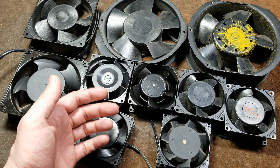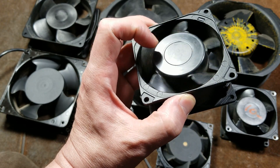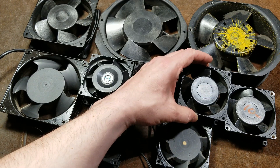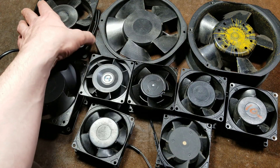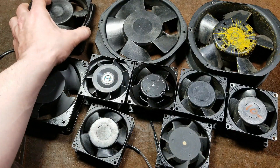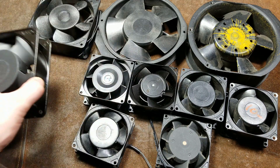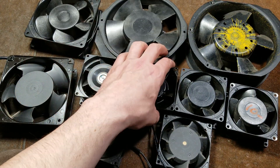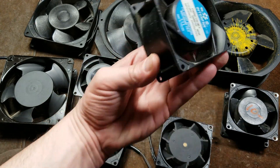It's one of the reasons you don't actually see bigger fans in brushless DC — the electronics are too expensive and the advantages of power density aren't required because now you have a big fan, you can put a big motor in there and it makes very little difference in the amount of area that's blocking. People don't specify fans for how much they weigh. All these fans are really heavy because they have laminated iron on both the moving part as well as the stationary part. It seems that NMB is the only company that really has a big market in both AC as well as DC brushless fans — otherwise it just seems to be all sorts of random different brands.